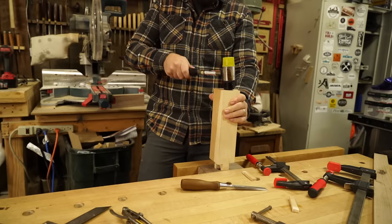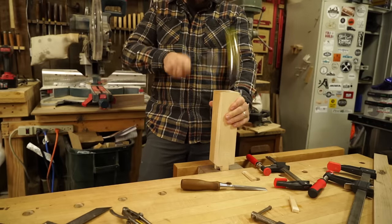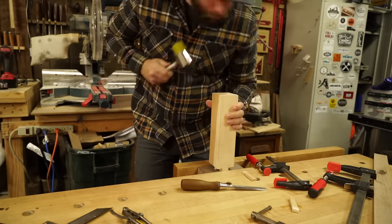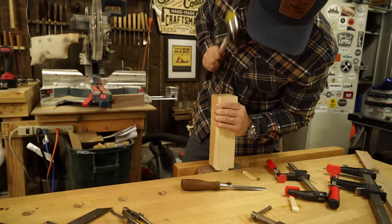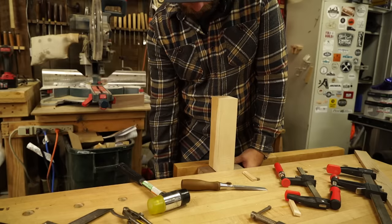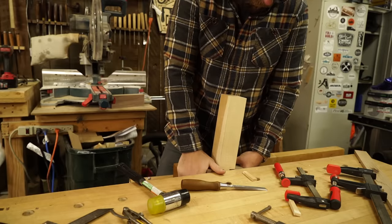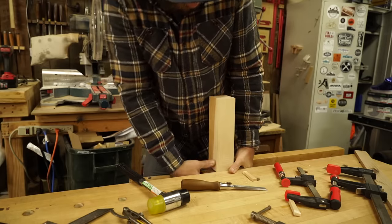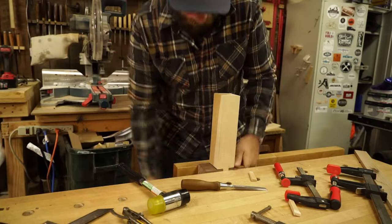And because this is a bunch of fancy exposed joinery, you don't want to cut everything too loose, because any gaps are really going to stick out like a sore thumb. But if you do everything just right, all the pressure is going to release just as it seats, and your joinery will look awesome. Here the through tenons were hitting the screw on my vise before they could fully seat, so I took off just enough pressure on that vise to raise it up enough to finish seating the handle. I was still worried that everything could explode at this point, so I didn't want to take any chances.